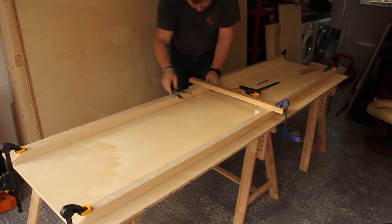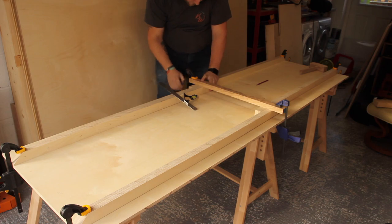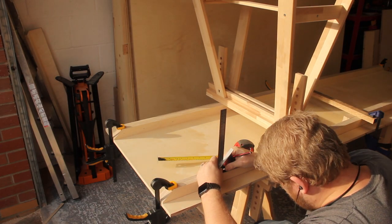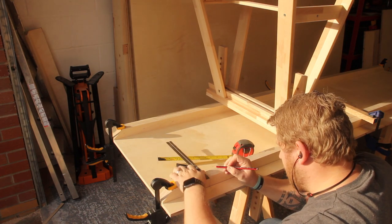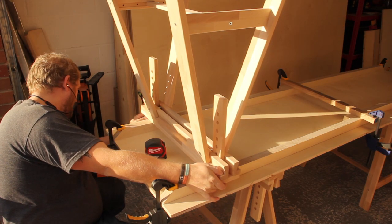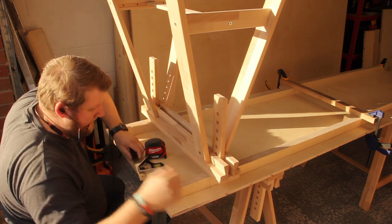You can see how this is going to look — I've got four joists which are going to be underneath to give the table support. I'm quickly clamping them into the middle to get the measurements right, then measuring out where to cut notches so the trestle legs will slot into them — sort of like a half-lap joint — so the legs will fit in nicely. Just giving it a quick measure up to make sure it actually looks okay.